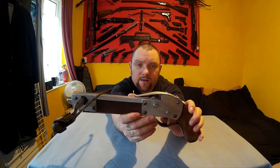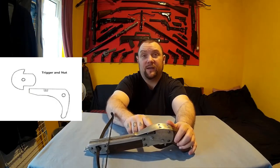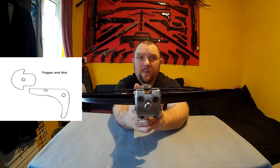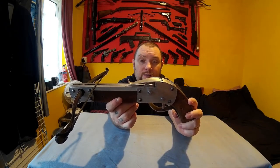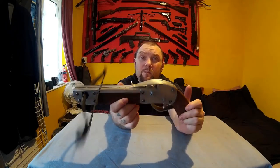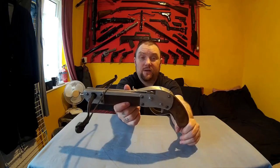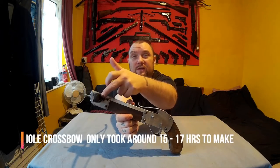This works on a roller nut system, which is basically just a round piece of metal with a little bit cut out in the top and bottom. The top receives the string and the bottom receives the trigger. It's got quite a heavy trigger pull — to shoot quickly you do need two fingers, though you can shoot with one. That is the nature of doing a very simple crossbow: it will have a quite hard trigger pull. The only power tool I used for this entire thing was a drill, really just to drill the important pivot holes, which had to be accurate.